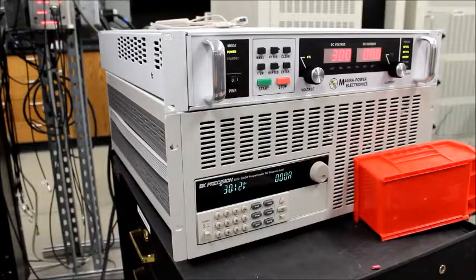All right, the last test is the constant voltage. So the application for this is somewhat obscure. Why would you want to do a constant voltage loading? This comes out if you want to do a sort of a braking on a DC link for a motor drive. So say you have a reference voltage of say 300 volts, but the motor drive is bidirectional, and you want to prevent the voltage from going over 350 volts. So this will sink current to maintain voltage that you set.